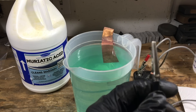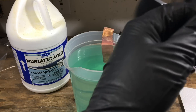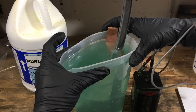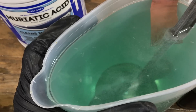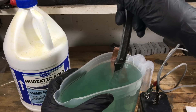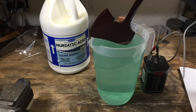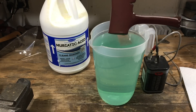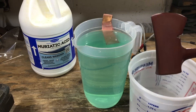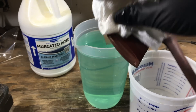The reason the solution is green is that originally when I did the hammer it was clear and transparent, but the more I've used it the more copper ions have been released from the copper anode into the solution. You can see the bubbling as it starts to deposit the copper. When it's first done it's kind of a dark reddish copper color. Rinsing it first in water to rinse off the acid, that darker red wipes off and you can see the copper that's been deposited underneath it.